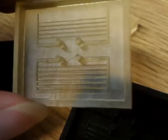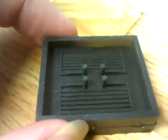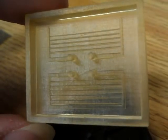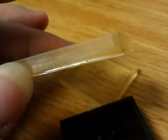The scratches you see on all of them are the same scratches. This comes from the acrylic in the vat — because it's acrylic, it's very easy to scratch. Every time you wash it, it scratches. So we need to find another material to make the vat, like glass, but it needs to be UV transparent. Borosilicate glass would be a very good choice.